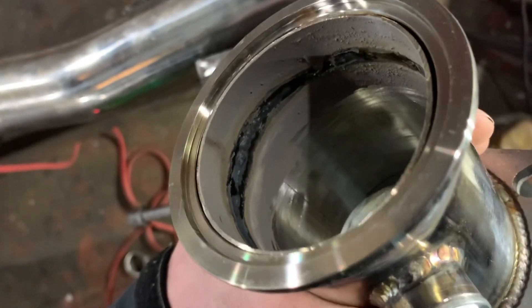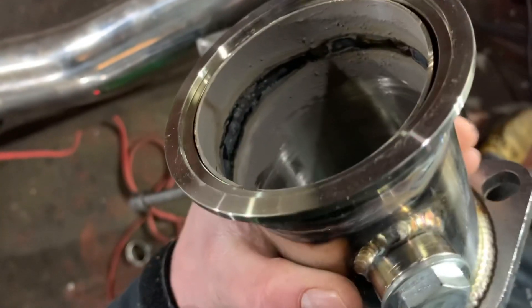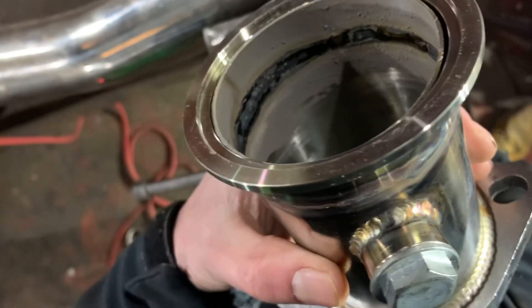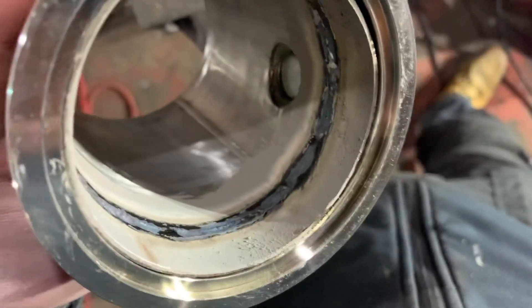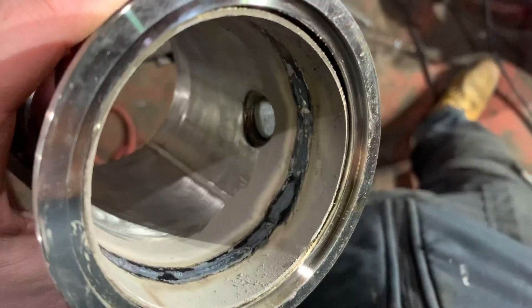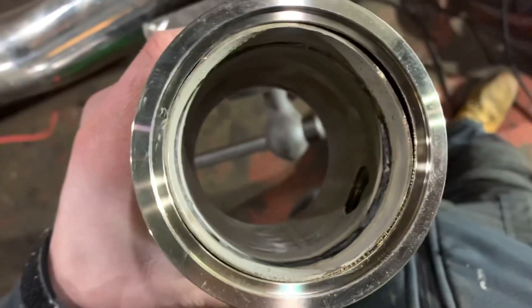There's a few little punch-throughs — just where I went a bit too heavy on the dip in the rod, probably a little bit too much heat. But mostly it's quite uniform. Most of it cleans away pretty easy as well. Fairly happy with that.